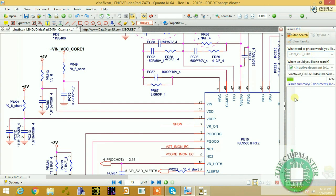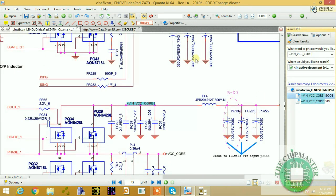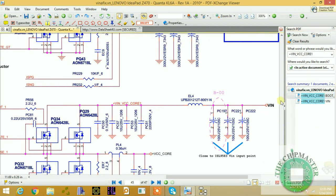Alright, so normally, as I said before, this signal Vin is from the adapter, which is generally 19 volt. Let's select the first one. As you can see, it is coming from this coil. So Vin is coming through EL4, which is that coil, used for electromagnetic interference with these capacitors, right? As I said before, these coils are used to block high frequency, so to protect your devices from electromagnetic